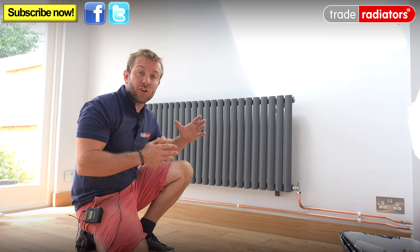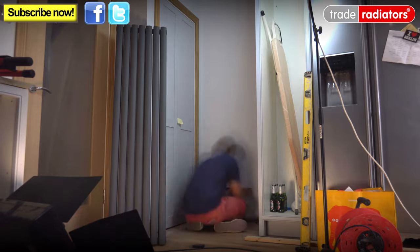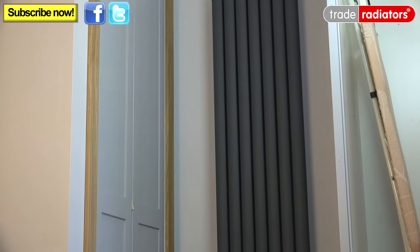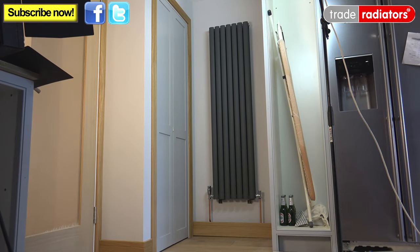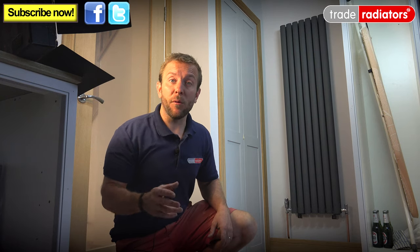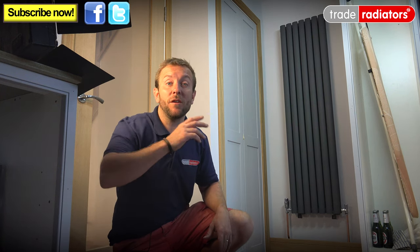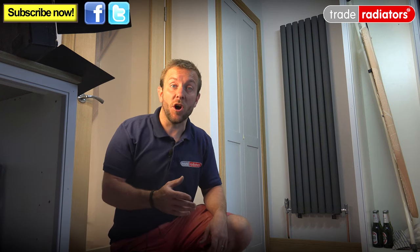Let's have a look at how these radiators can transform the other spaces in this house. As you can see, this radiator has completely transformed this little space. The pipe work across the bottom is going to be boxed in by the carpenter but will also be removable because we've got a drain off in there. It's always very important to remember that any drop-down leg radiators — the ones that aren't running along pipes along the bottom of the house — have their own drain off on them. Otherwise, you'll drain the rest of the heating system but that radiator and drop-down leg won't drain if you want to work on it.